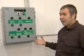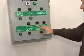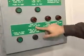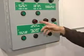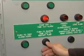Under normal operation we'd see about a 10 to 15-minute fill cycle, and it'll come on as needed depending on your fuel consumption. The green light will come on showing the pump running and the actuator valve; it'll run for about 10 minutes and then shut off. We also have some alarms. The first is the pump timeout alarm — the most common cause would be if you ran out of fuel in your intermediate tank, if your fuel filter was plugged, or if you had ice in the line. If the pump ran and didn't get the tank full, you'd get an alarm horn outside and this red light would turn on. To clear it, press silence, timeout, and restart pump, which will clear the alarm and start another normal fill cycle.